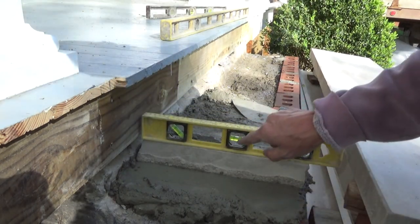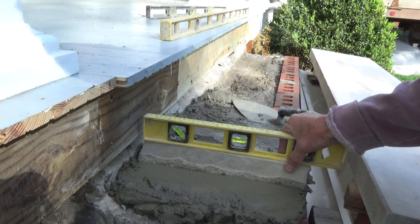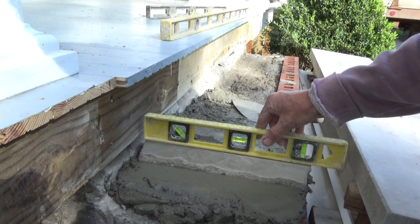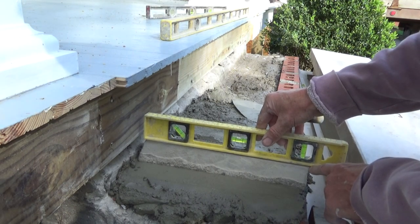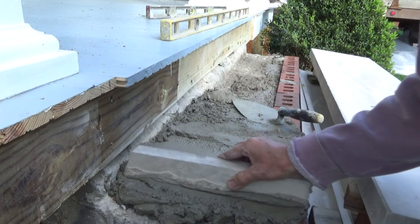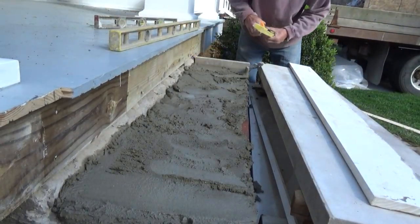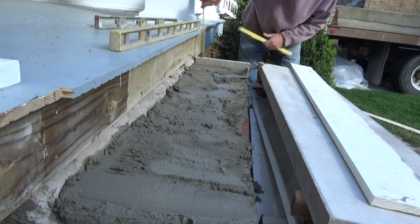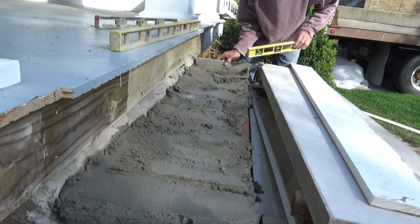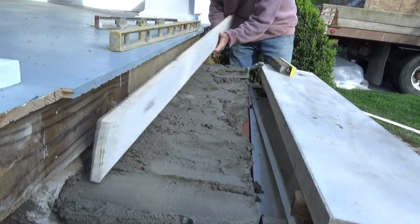I want about a quarter of a bubble — that's level. That way the water's gonna hit it and roll off. I got that little bit right there — that's a stone pitch down. So I know on this side that's my height. Way down on the other end, same thing: seven inches down, a quarter of a bubble — that's my height. Now I just go between that, just like pouring concrete.